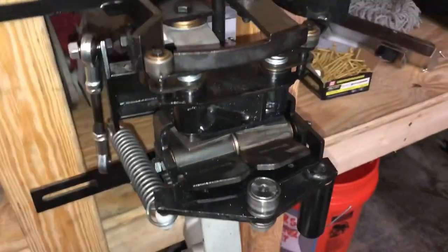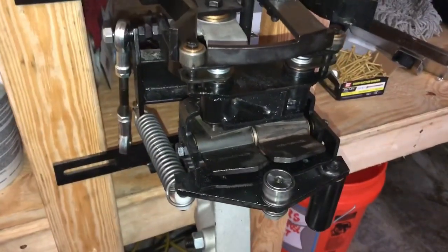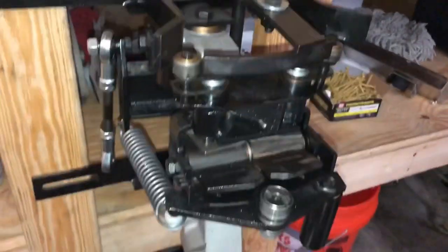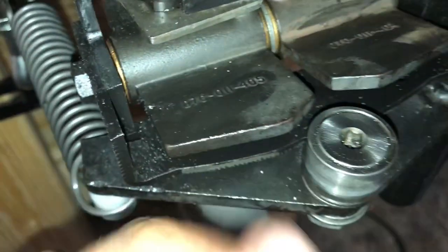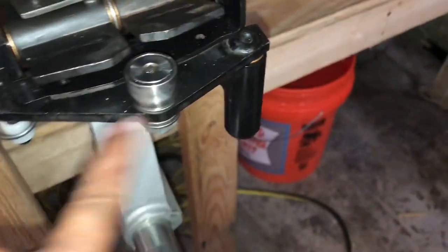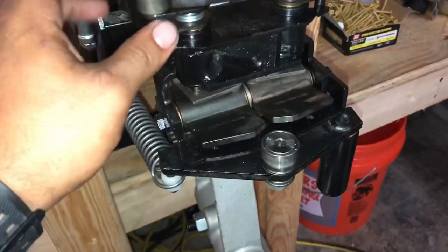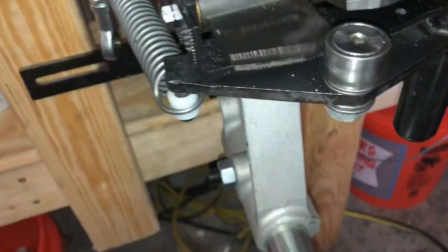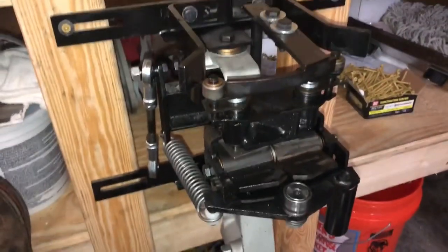When I put it in I'll put a little oil there, a little oil there, and a little oil on the bushings on the back on the rudder drive — but that's it. That's all it takes, and that's every six months or something ridiculous. Now that this is set, I'm not going to have to touch it ever. They don't come unset as long as the hardware stays tight. You're going to start to get some wear on these cams and along the bottom, but the important thing is to keep most of this dry except for those little places where you get a drop of oil.